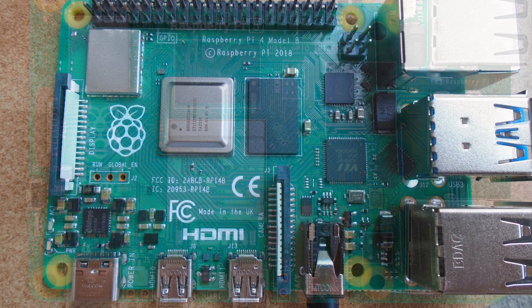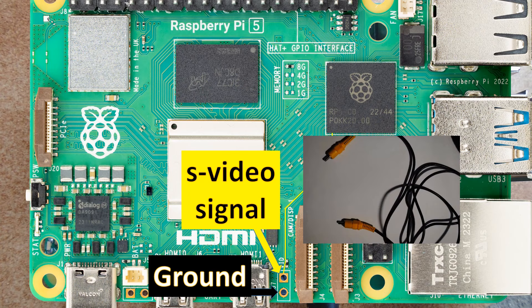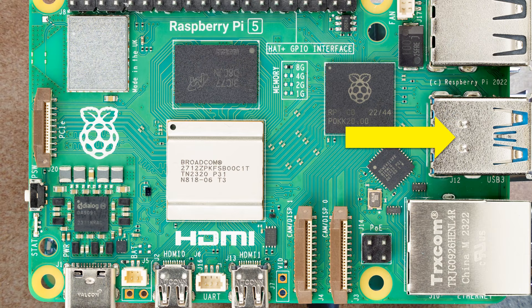James added that Raspberry Pi 5 also supports video output for older TV sets through two pins on position J7 between the HDMI 1 port and camera display 1 connector. A video cable or connector may be soldered to J7 pins if needed. However, many would still prefer an audio output jack to connect the little computer to a powerful old-fashioned audio amplifier.